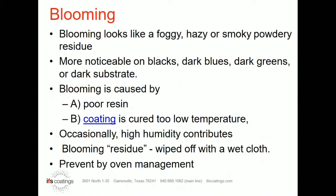There are a couple of ways to fix that. Obviously, the proper way is to have a resin that will not bloom, though that will result in a higher priced product. The other way is to make sure you have proper temperature in your oven, no cold spots, and that thick metal reaches temperature consistently without being held in that 300 to 325 degree range for very long.